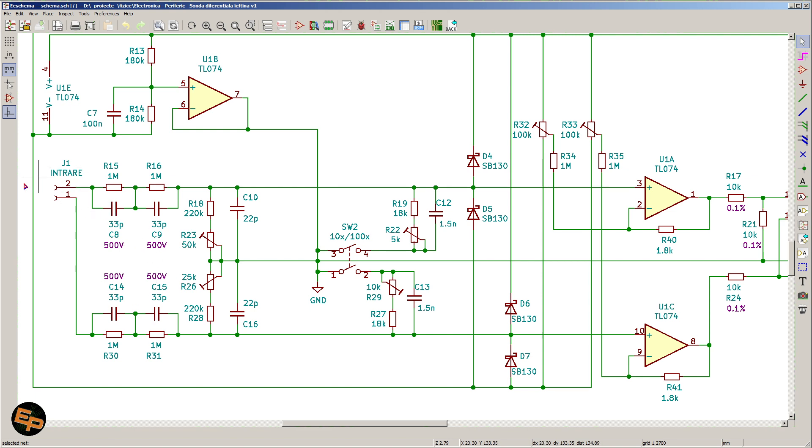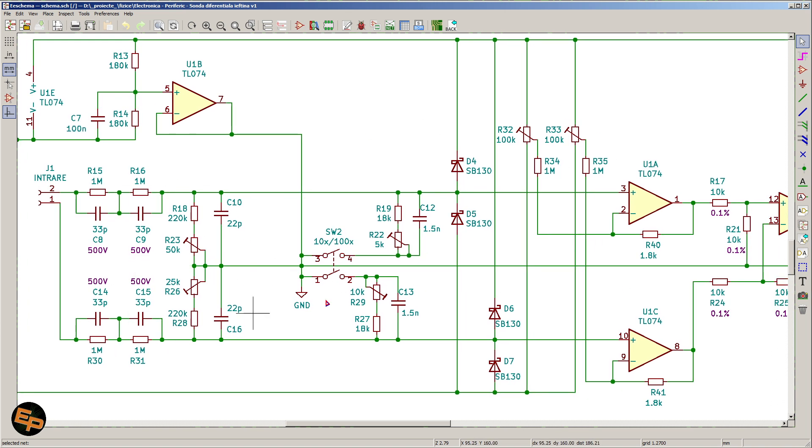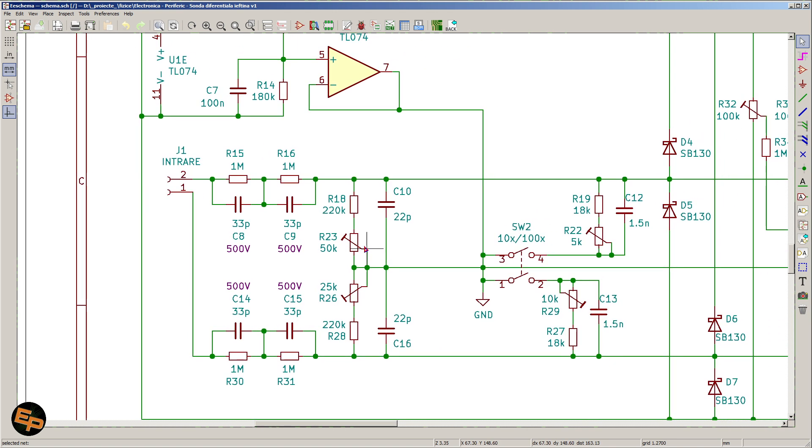The smoother the power voltage we give to our op-amps, the less noise we will have on the output. So it wasn't an overkill to add that extra circuit — it actually brought real improvement. If we take a look just at the noise on the oscilloscope, it's about 10 millivolts peak to peak — something to keep in mind when evaluating results. Leaving the power supply aside, now let's take a look at the actual differential probe — the actual attenuator and amplifier circuit.